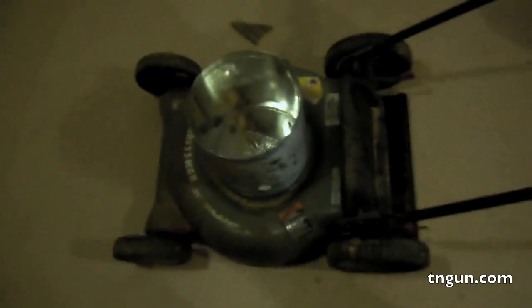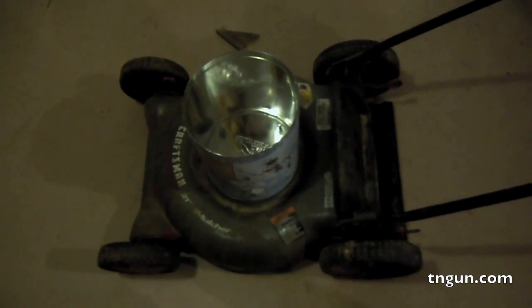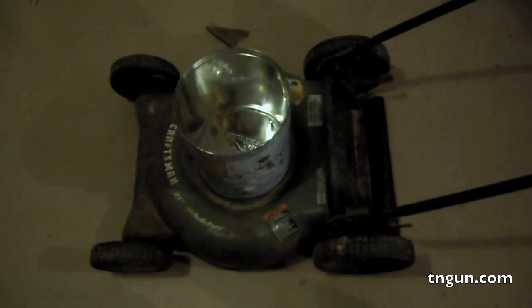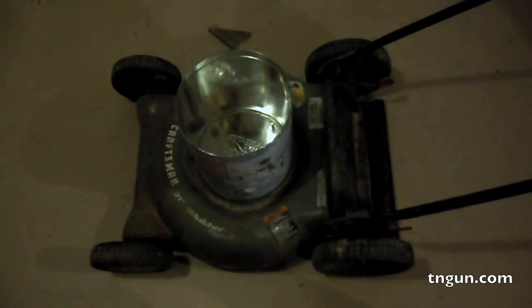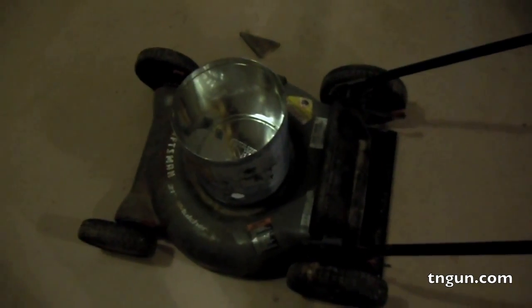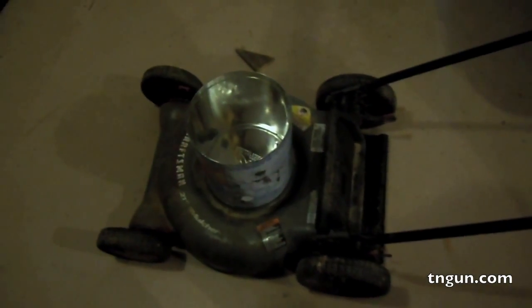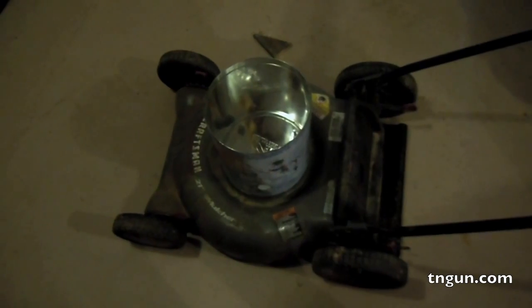We also went a little different on the instructions — I didn't just leave the bucket; I wanted to be able to move this thing around. It's pretty fragile, and if it's anything like fire brick I don't want to pick it up and toss it around. So I put it on this old wheelbarrow or lawnmower body I had left over from the generator project. The only other thing we did was cut the air hole in there, and now we're going to pound the refractory in.